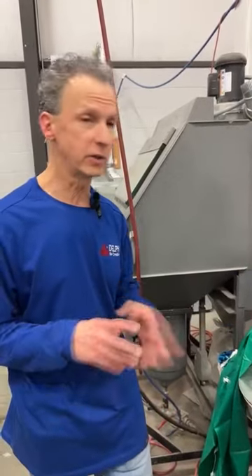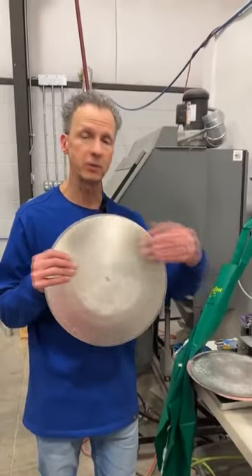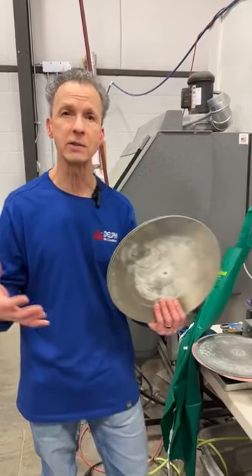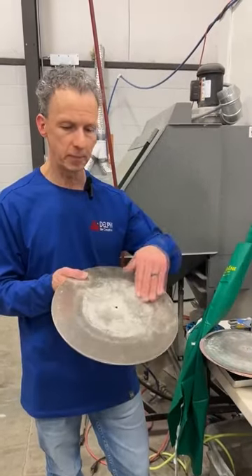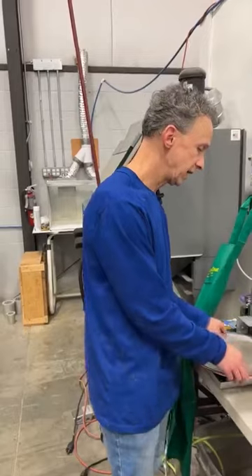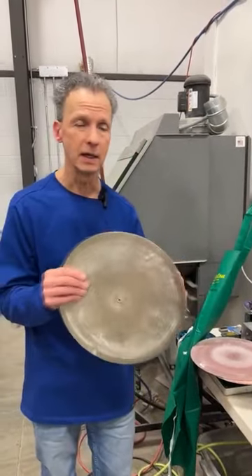I'm going to show you what some of the things it can do. We're selling these as a kit — you buy the machine and you get four discs with it. There's a 100-grit diamond disc. It has a diamond coating and it's 100 grit, so it's more like what you'd call a standard grit on a home grinder — about 100 or 120 grit — pretty good for just knocking stuff off. It also comes with a 270-grit disc, more like what we'd call a medium grit for refining a bit.